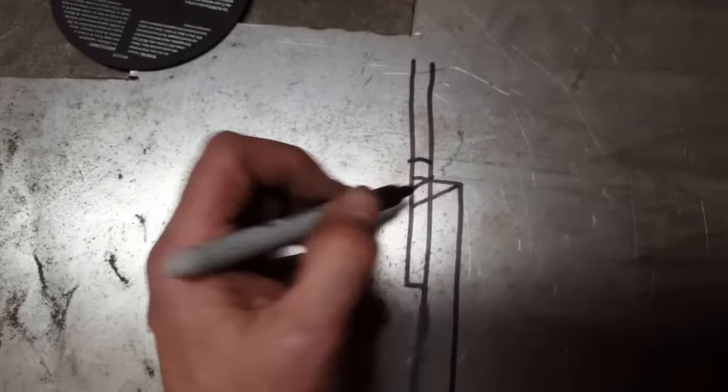Now I've got that corner tacked in place, and as you can see, I lay this piece of metal against it. It's flush, just in that corner. I'm going to go along there and it's flush here. Now if you look at it going across here, I've got that lip sticking out, but as you come across here, it'll pass right on over it. Now what I'll start to do is go along here and start cutting this on a 45. I'll cut it on a 45, and what'll happen is this will start to fall in as it's going across. Don't cut too far, because if it cuts too far it all goes flimsy and it'll be too hard to control. By cutting like 2-3 inches at a time, you get lots of control of it. You'll just keep an eye on it.